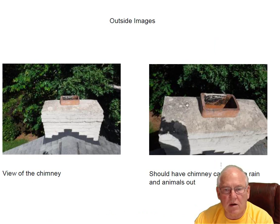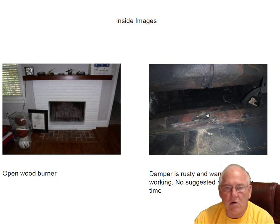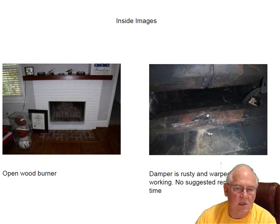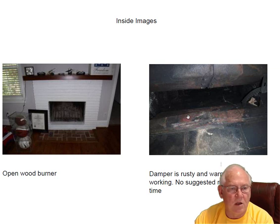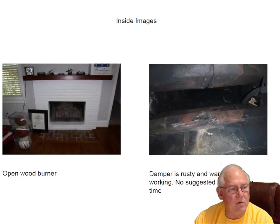The crown — the concrete work up here — looks pretty good. There's no chimney cap on here; there never has been, and that's one of the reasons why the damper has a lot of rust. As a matter of fact, it's actually warped. But even with all the rain and the warping and rust, it's working just fine. Since it's income property, I wouldn't bother switching it out, but it would be a good idea to put a chimney cap up here sometime — I've given you a price on doing it.